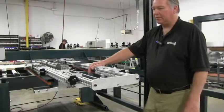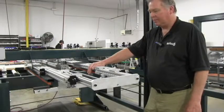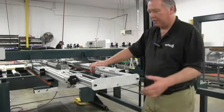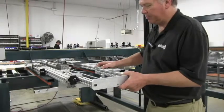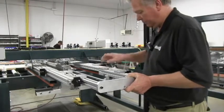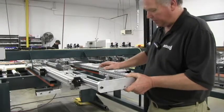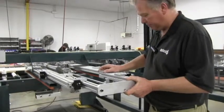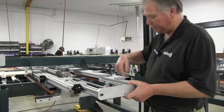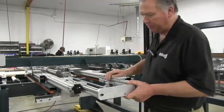This is the gripper on the 530L loader for the Eagle and the 5000 system. When the gripper is fully open, it should be adjusted so that there's a little bit of play in the system. There needs to be a little clearance between the top bearings and the end plate — about a sixteenth of an inch will do it. If that play is not there, the cylinder fully strokes, the bearing plate leans against the end tabs and will eventually knock the end tabs off.